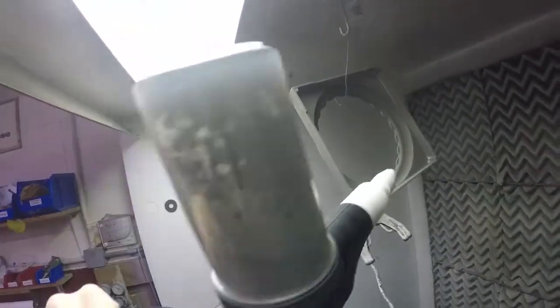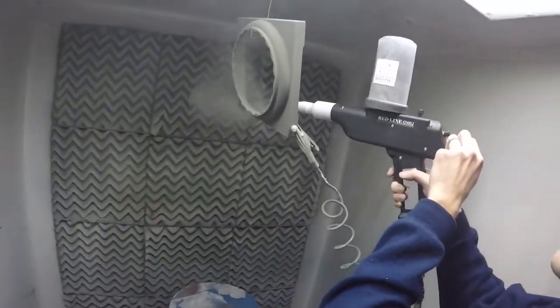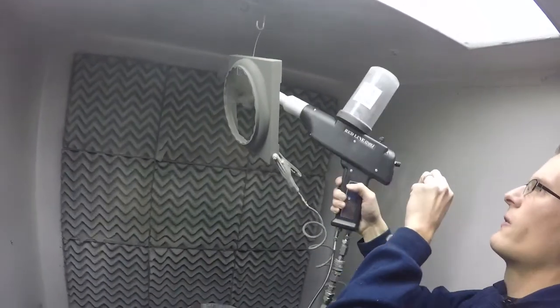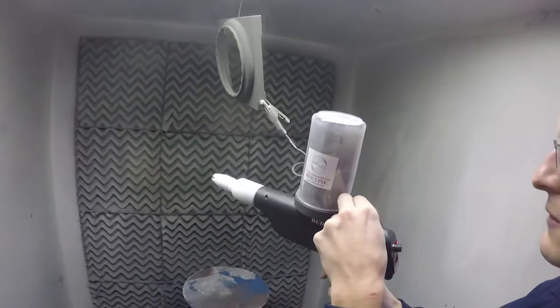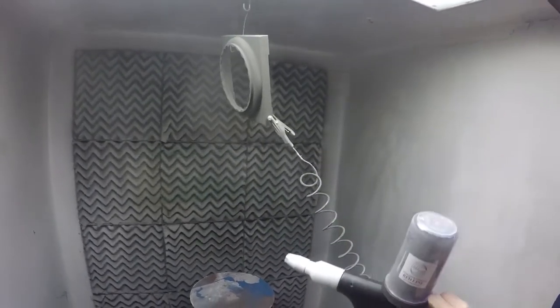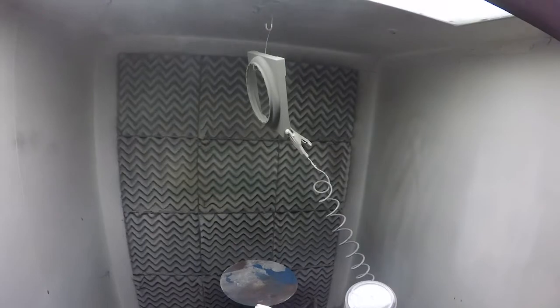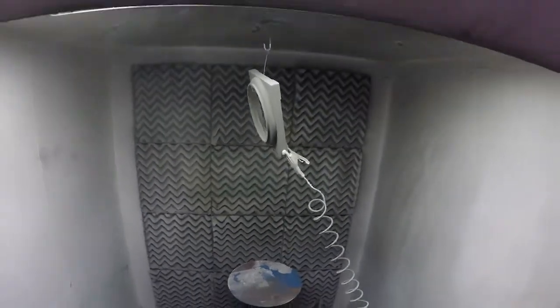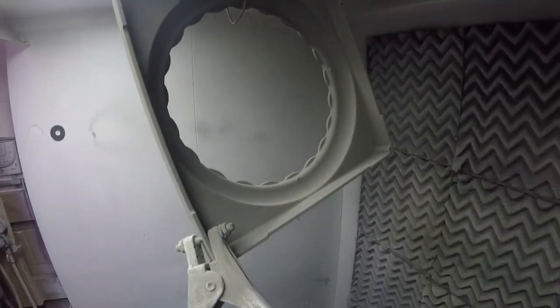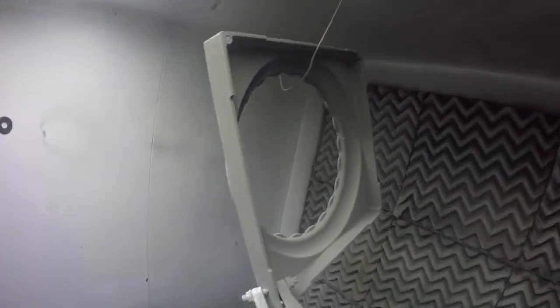In corners where there's a Faraday effect, you could drop the kV and get in there appropriately. So the gun is pretty versatile and does a good job for a price point that's slightly above the EZ-50 but a step below some of the higher, more expensive units — Wagners or GEMA units, things like that.